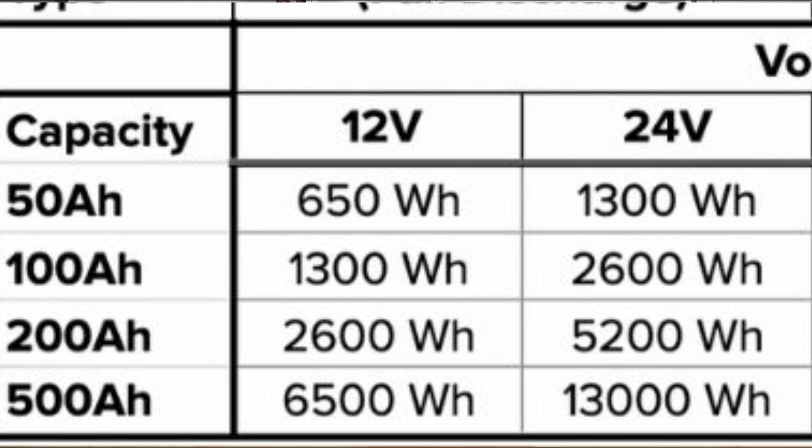That's the way the system is designed — your reservoir stays the same even though the numbers change, because you're really changing your amperage and amp hours but not your available watt hours. Four 12-volt batteries at 100 amp hours or a 48-volt system with 100 amp hours is still going to be about the same size. Now that we know how watt hours work, we need to figure out how much we actually need and how much we're going to use.